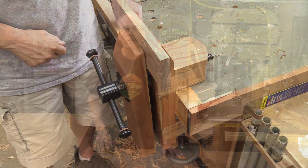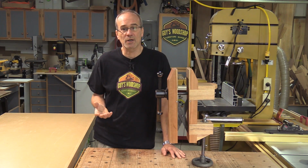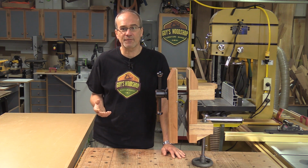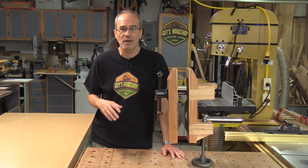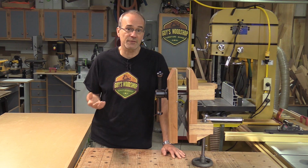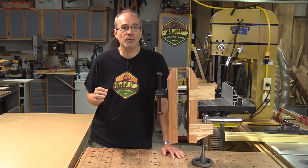Very nice. Now the plans for building the wooden components for the vise hardware are really just a starting point. They can be easily modified in style and dimensions to custom tailor fit for you when building your own Hi Vise. In addition, the Hi Vise can be considered a scaled down version of the Benchcrafted classic leg vise, and it is suitable for installing as a small front leg vise for your workbench if you wish. Of course, its initial design concept is as an auxiliary clamp-on vise to raise up your work to a suitable height so you won't have to hunch over.